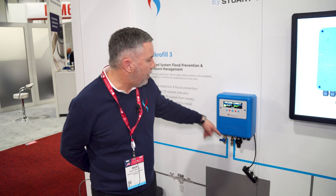It's a one-size-fits-all unit and it fills at approximately 3.8 US gallons a minute based on 30 PSI. The maximum incoming to the unit is 100 PSI. There's a 4.5 to 5 PSI pressure loss through the system, so a 100 PSI inlet can fill a system up to 95 PSI.